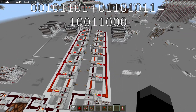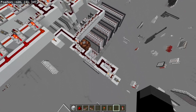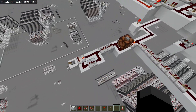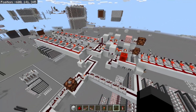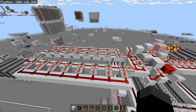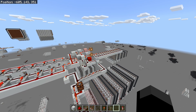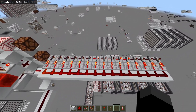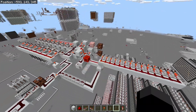What we're adding here is 45 plus 107, which should equal 152. Rather than clocking it manually, I'm going to use this clock I set up. Because we're adding two 8-bit numbers, you want to clock it nine times — one more than your input bits — to also get the carry bit out. In this case the carry out is zero anyway, but you'd normally always want that extra clock. We clock it once to load the shift registers, turn all inputs off so we don't corrupt data, then run the clock. Our result is 152, which is 10011000 — that extra bit isn't needed. And that's basically how we use the serial adder.